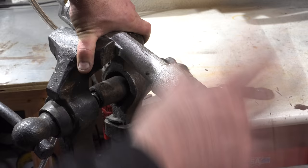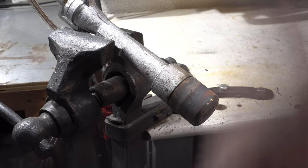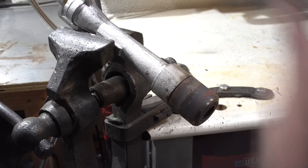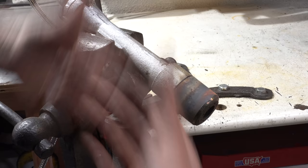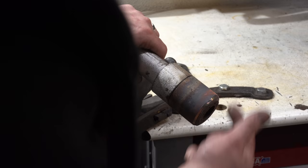I like the design of the burner. I do notice I'm smelling a bit of gas, and that's because it's a Venturi burner — there's a lot of gas coming out, and without an enclosed space that gas isn't igniting, which is very typical for Venturi burners. They do need an enclosed space, so that's why it's blowing out a little easier. Inside a hot forge it runs better than it looks here. I love the holes — it gives you more heat instead of just a straight nozzle. Pretty good design; I like it.